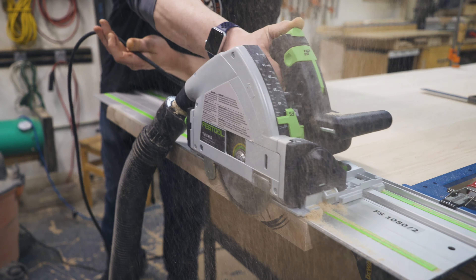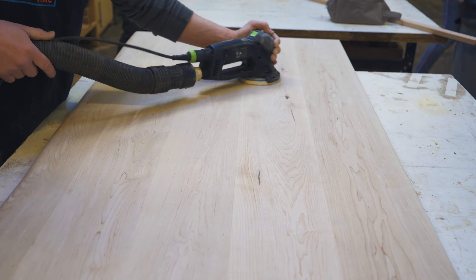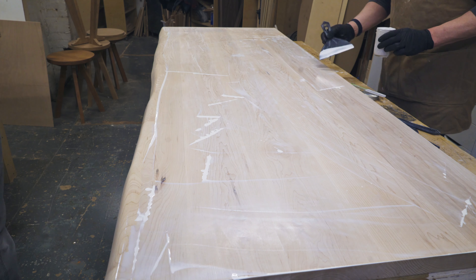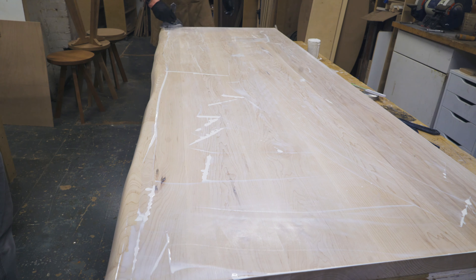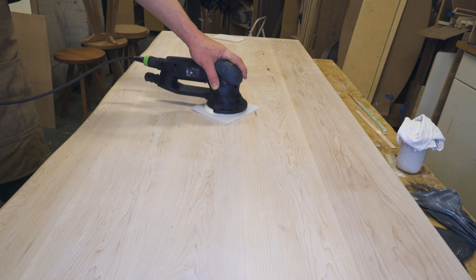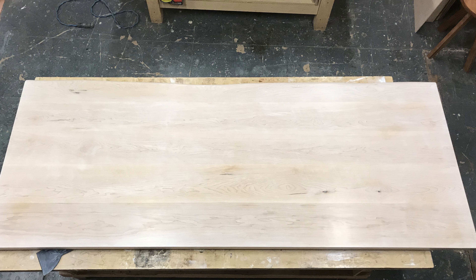So I re-cut it, this time keeping everything to the same angle and making the waves much more subtle. Then I hit it with the grinder for a good long while, sanded it a whole bunch, and then I was much happier with the result. Then I cut it to the final length, which I'd held off on to keep options open. When you work on hard maple — especially big thick chunks — it's difficult not to burn it because the saw just can't go very fast through it and you get ugly scorch marks. So what I do is cut slightly over length by less than the thickness of the saw blade — like a sixteenth of an inch — then move the track over and make a much faster cut to just get the burn off. Then I sanded it, and I did not do a good job. I thought I had, but I hadn't. And this is where I learned a hell of a lot.